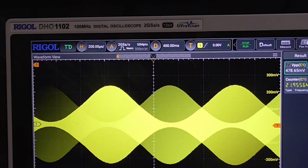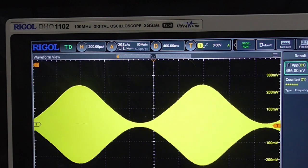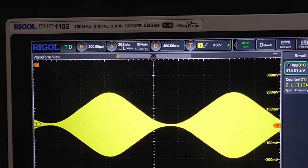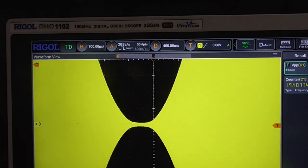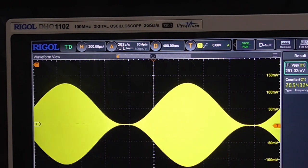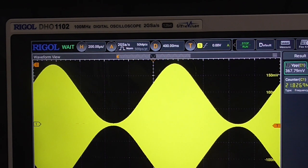If you take it too far on these they tend to overreact a little bit, so that looks good. I'm going to go back into standard mode — I just want to check a couple of things. Sometimes if you over-adjust these I find they tend to flatten off when you're out of service mode. I want to make sure when I adjust the RF power — this is high power right here. Now I'm lowering the RF power down. You can see what I mean there — that's the low modulation and I over-adjusted it, so it's a good indication I went a little too far. See how it flattens right out. So when you go all the way down it comes back, but it's usually between RF power 2, 3, 4, and 5 that it gets really bad. I've got to fix that.